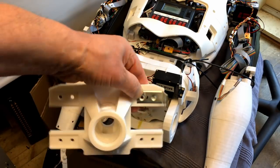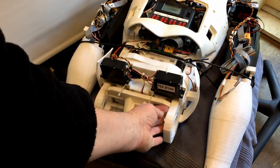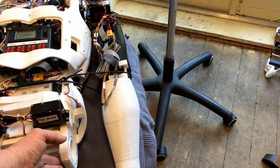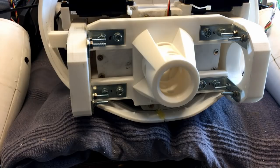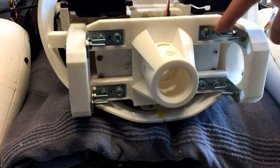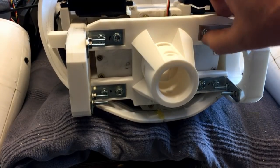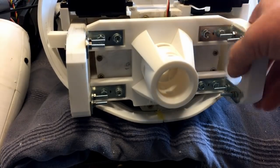On the designs it's shown drilled through the base, but I've always put an L-bracket and drilled it into the sides, as you can see on the original ones, just to give it more structure. This new one is going to do the same — it'll have L-angles that sit in and drill through into the support structure. I've now got the bracket mounted on the base of the InMoov. I had to file down the corners slightly as they were sticking out. The L-pieces from the hardware shop varied a bit, but I managed to get them all in. I've re-drilled holes through the side — four bolts on the sides, four at the top — so it's as solid as it's going to be.